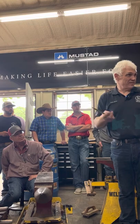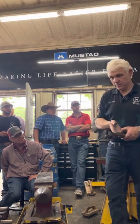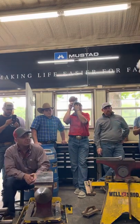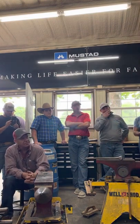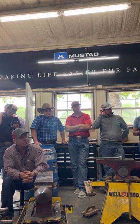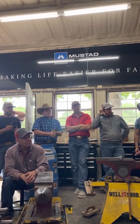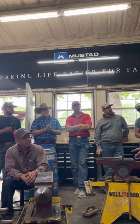You can see it too. You might be too much in a hurry to notice it yourself, but when you watch somebody else do it, I really saw that. It was a dark red, and then it just came right back to almost orange white. So it's not how fast you are. Take a breath. Okay, now it's ready again. Keep going.